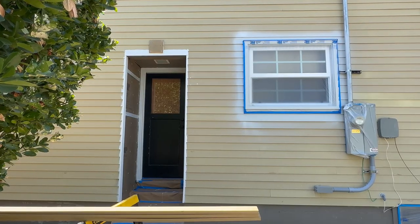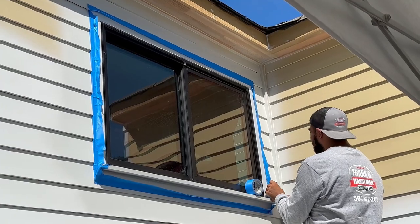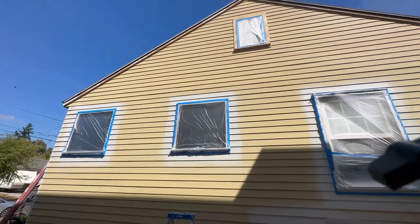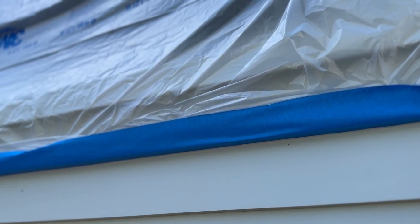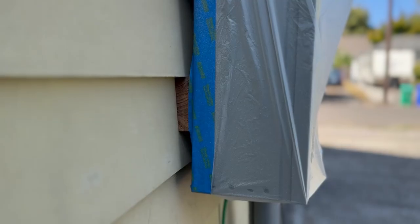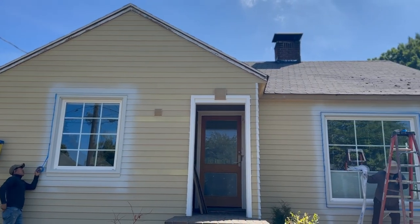As you can see, we already painted this trim around the windows yesterday. We put some primer on first, then once that dried we applied the customer's desired paint color — we hit it with two coats. So the trim is already painted and complete, and now we want to protect it. To do that, you just put the blue tape around everywhere.